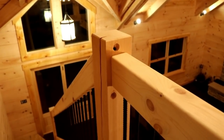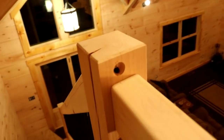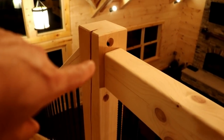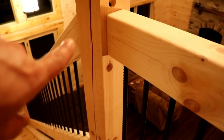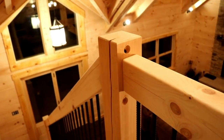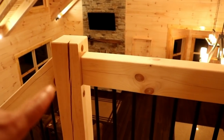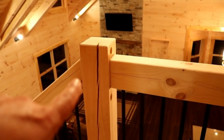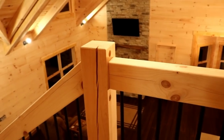At the top of the handrail you'll see a plug where there's a log screw inside — it's a smaller screw going in at an angle, angling down into the handrail. There's also one at the bottom angling up into the handrail. That top rail also has screws through it that the handrail itself covers up, so you don't see those screws.